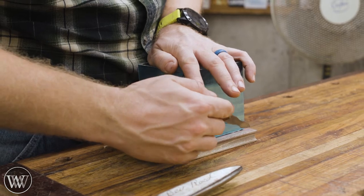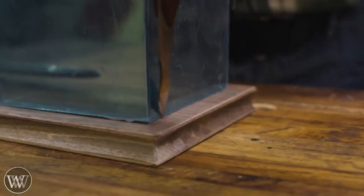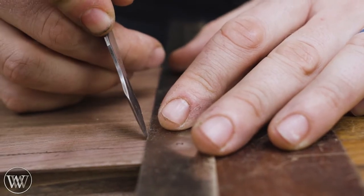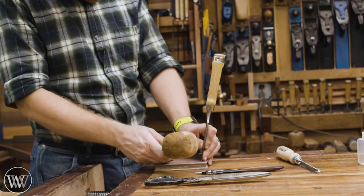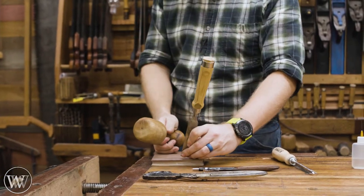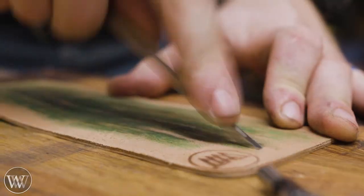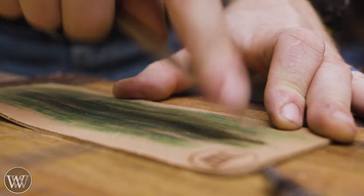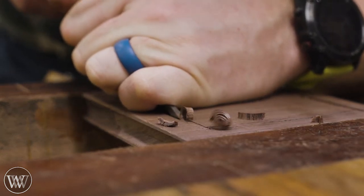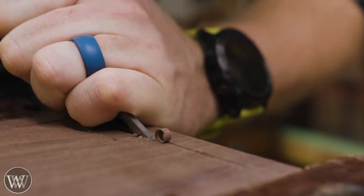Once I have the four sides glued up, I can put that onto the base and trace out where it needs to go. You need to be very careful because I want a nice tight line on the outside. The next thing I want is a groove for it to go into. Thankfully, I have an eighth inch chisel, which happens to be the exact same thickness as the glass — an eighth inch. So I can lay out the line to the thickness of my chisel, then lightly chop in on both of those lines, inside and outside of the track. This gives it a slightly deeper cut that we can then come in and pare out. It's always good to sharpen up the chisel and make sure it's honed and ready to go. Then we can chisel it out — these tiny little curls pulling out of the groove were absolutely gorgeous. I was excited — can you tell? I was having a little bit of fun here.